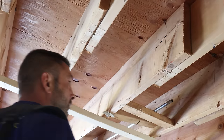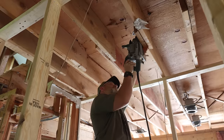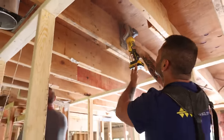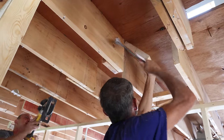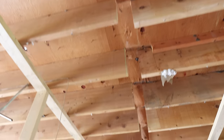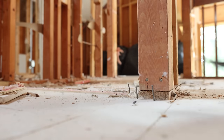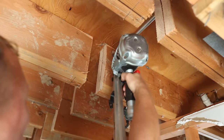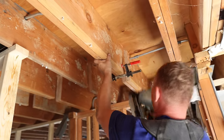In order to get our beams installed we need to cut out a section of our floor joists from below. After some precise measurements it was just a matter of cutting out those floor joists with a circular saw and a sawzall. You can actually see where we're cutting — the floor joists are meeting right there. One floor joist comes from our kitchen and the other comes from our hallway, and that's another good way of telling where a load bearing wall would be: right underneath where those two joists come together.